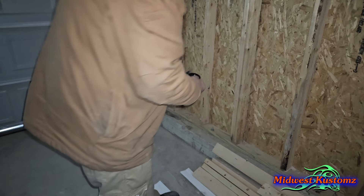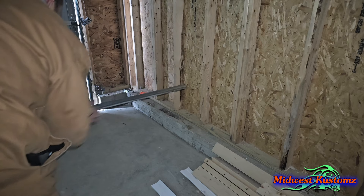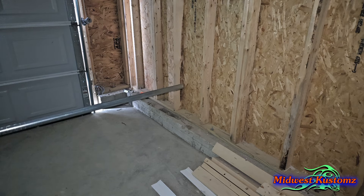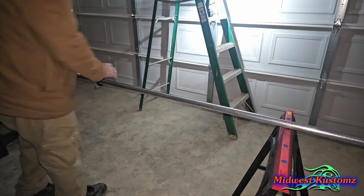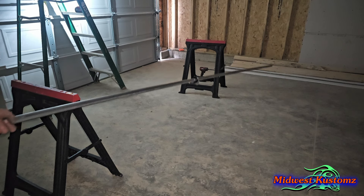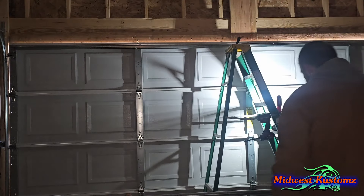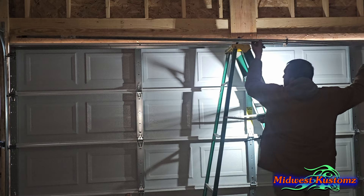Notice the spring isn't out over here — that's what we're going to do next. The L toward the bracket goes to the left. It's got a little V in it and so does the spring, so you just fit it around the spring and get it on there. Some of these slide on easy and some are a pain — the plastic is probably manufactured tighter. Slide this down to roughly the middle. Now on the other end, the spring has to be out like this, so I grab that side and hold the spring so it doesn't slide back in, then start walking the spring out.